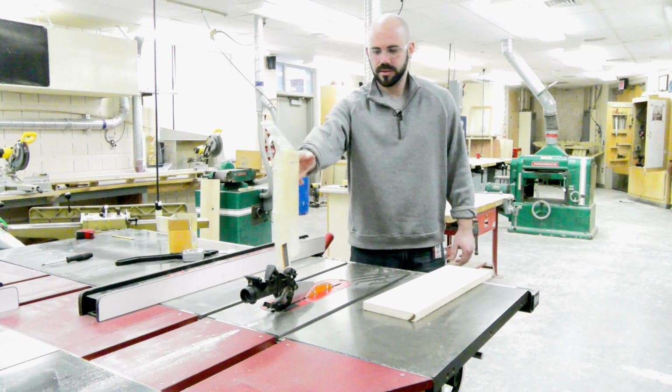In my case, we're running a 1/8 inch blade. I'm going to make sure I'm measuring between this side of the saw blade as well as this side of the fence. So I'm going to measure that and double check we do have 10 inches exactly, which means that our fence measurement system is accurate. Occasionally, as these fences get beat up, people change out the thickness of the actual fence, which will throw your measurement off either 1/4 inch or even more drastically sometimes. So double check that.